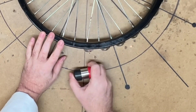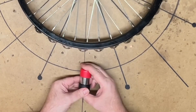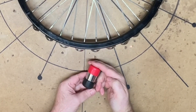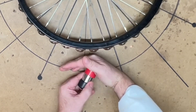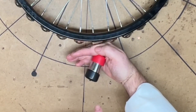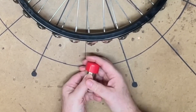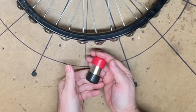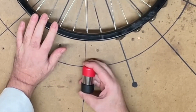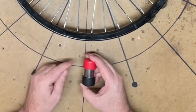I discovered something interesting: if I allow this to rotate a full 90 degrees, the wheel really picks up speed. But for right now we just need at least a natural 17-degree turn - it's turning at about 12 degrees by itself. I'm not doing that. You can see the angle - it naturally wants to go that way. So we need it so that once the last magnet clears, this will snap back, which means we need a spring on the side.